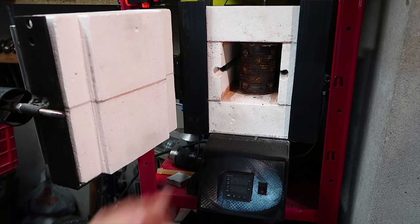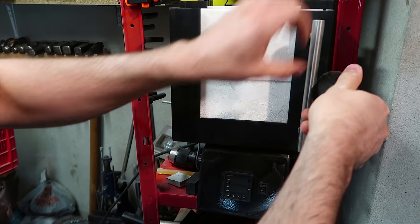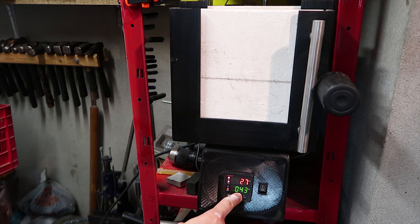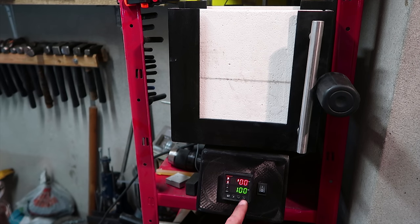Then I place all the flasks inside my heat treating oven to fully dry and cure the plaster, and of course to burn out all the wax. That will leave a cavity for the aluminum to flow in. This burnout process started early in the morning till late afternoon to let the molds raise to temperature very, very slowly, again to prevent cracking.